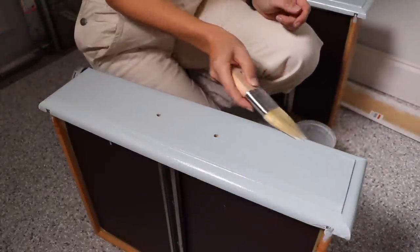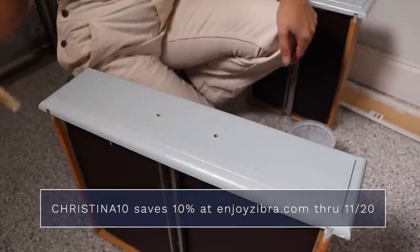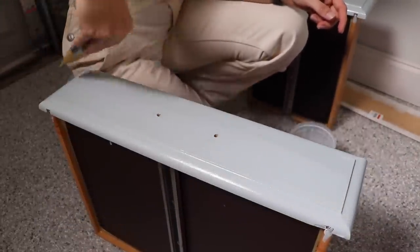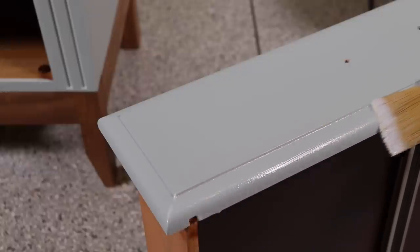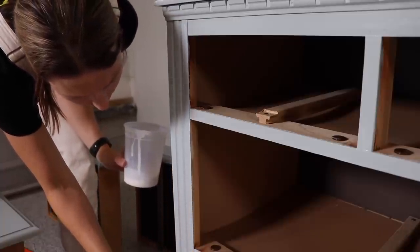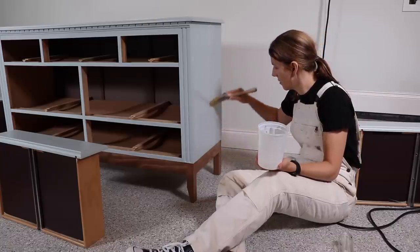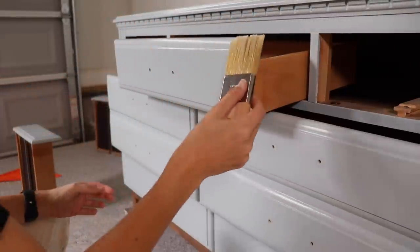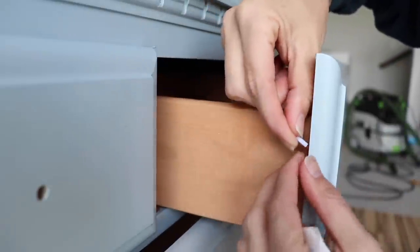There's a discount code available for another week, so get those ordered. This Varathane top coat is water-based — it goes on milky white and dries crystal clear. It's a satin finish which is a bit shiny for me; I'd like to try their flat next time. After the first top coat dried for two hours, I did a second coat — I can see why furniture artists love this product. I ended up doing a third coat on this piece, doing the drawers last and putting them back in to check evenness.